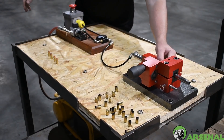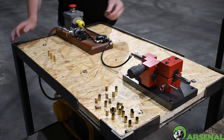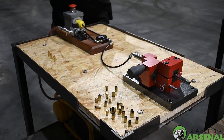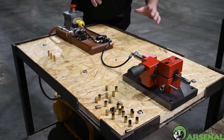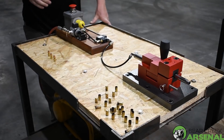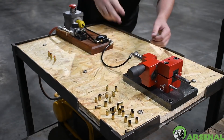This style system is a lot better than the last one. With the previous vise, the pistol had to be in the vise with the barrel inside it — so you had the polymer on the upper and the barrel inside the upper, meaning a lot of different parts and variation. This new one brings it all down to just the barrel, so we can dial everything in a lot easier with much less variation in testing.